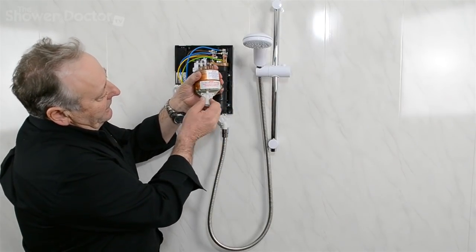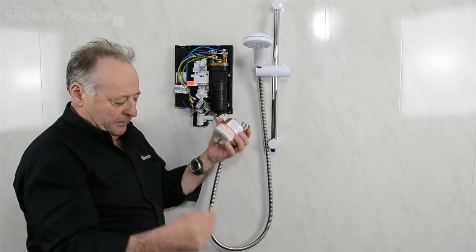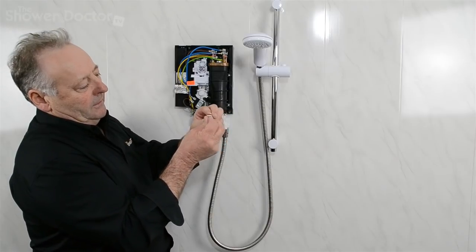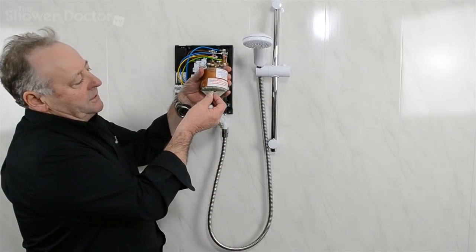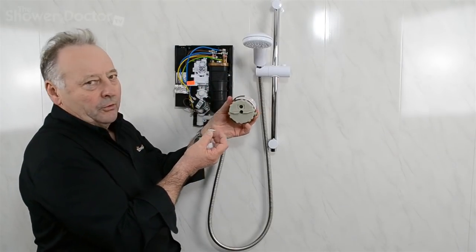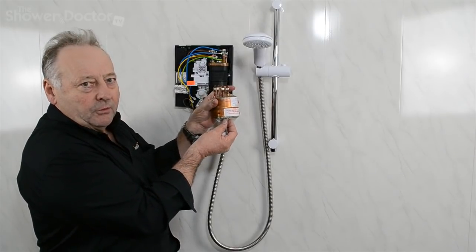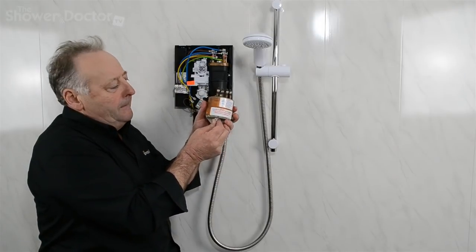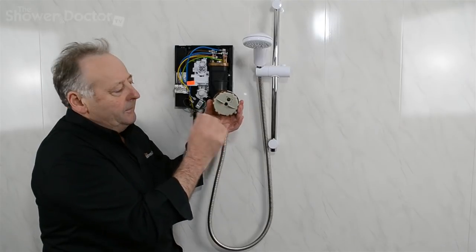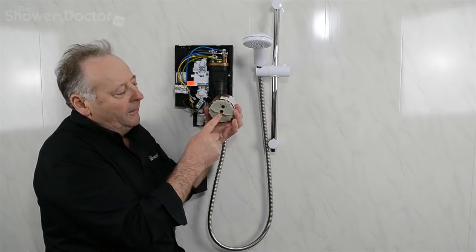The tank has the outlet pipe placed here. What you normally need to do is pull this away and then you can pull the pressure relief device out. Fitting a new pressure relief device is fairly straightforward. You must make sure that you place a new O-ring on the pressure relief device, then all you need to do is push the pressure relief device into the bottom of the tank. The only thing to be careful of is to make sure that the old O-ring has come out of the bottom of the tank — it can either fall into the bath or shower or be left in there. If you have two O-rings in there, it will be impossible to replace. Make sure the O-ring is clear, and when you take the outlet pipe out, make sure the O-ring for the outlet pipe is still in there or that you have a new one. Usually the outlet pipe O-ring stays in, but it's something to watch.